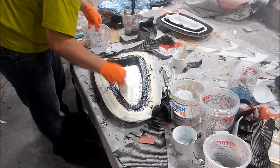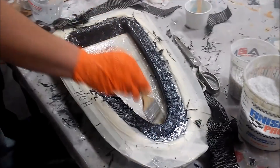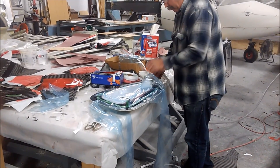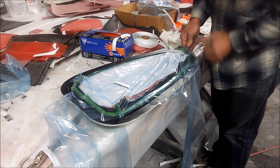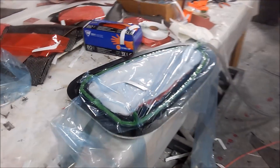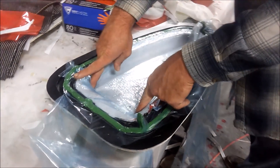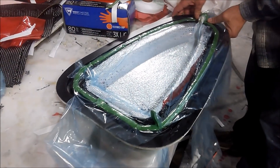You can see the core is in there, being wetted down in preparation for putting the finishing layers on to close the whole thing out. Then it'll be peel ply, bag, and tag. That's exactly what Jeff is doing here — he's already got the breather fabric and other materials in, and he's prepping the bag. He gets the bag sealed, then cracks the valve a little on the vacuum tank to start drawing vacuum, pushing the corners in to make sure the bag is stretching out nicely. Then he gives the valve a full open and it pulls down tight — that's how you do it.